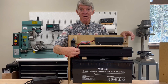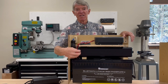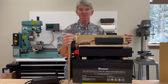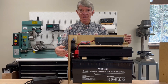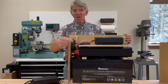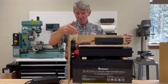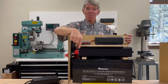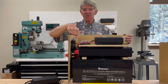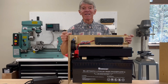Above that is a 3,000 watt Renogy inverter, and that is primarily there to put out enough power to drive and power up the electric water heater used in the shower. It also runs a lot of other things too — hair dryers, microwave, all kinds of things. You'll notice that I've actually mounted it upside down, and that was so that I can align the positive terminals on the battery with the positive terminal on the inverter, which allowed me to cable those two together with really short six-inch cables made out of number one gauge wire.